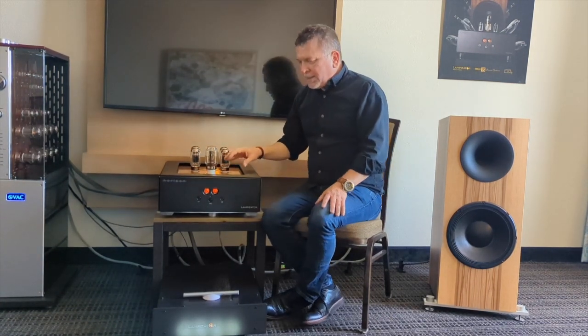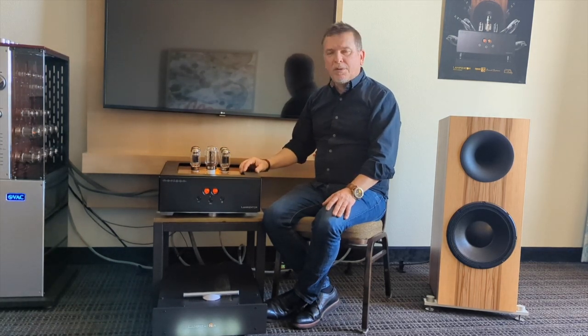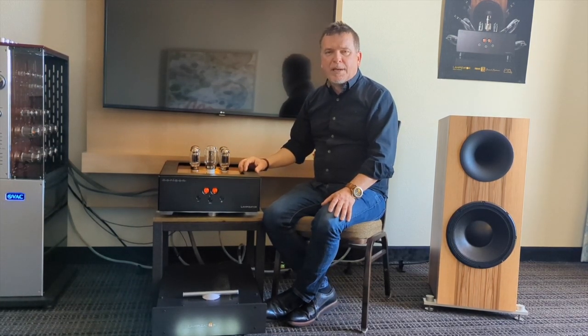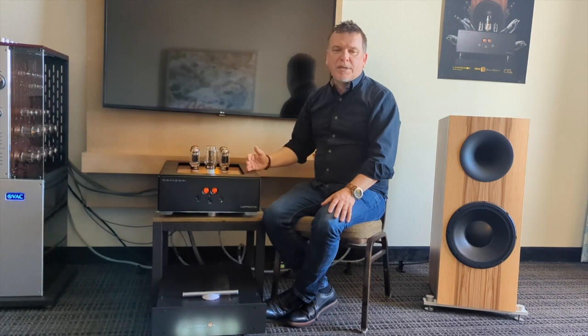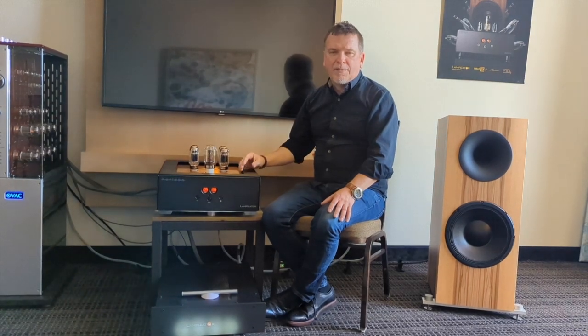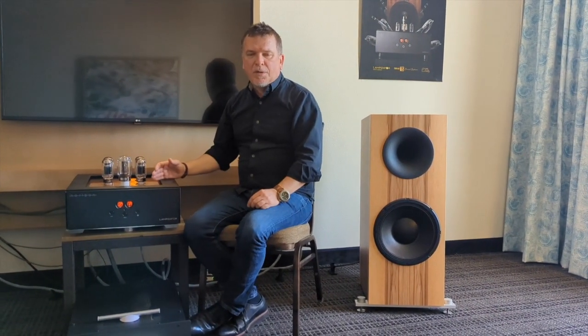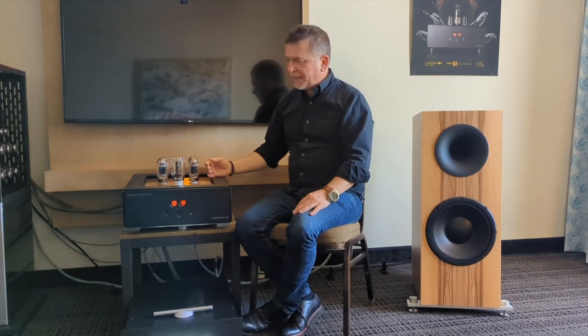But what's inside in terms of electronics? Let's start from the power supply. We don't use any impulse power supply. It's an easy shortcut. It's a simple way to achieve your desired voltage and current. It's probably much cheaper than anything else, the impulse kind of switch mode power supplies. We decided to not use them for various reasons, sound quality being the main reason, and then reliability, longevity, etc.